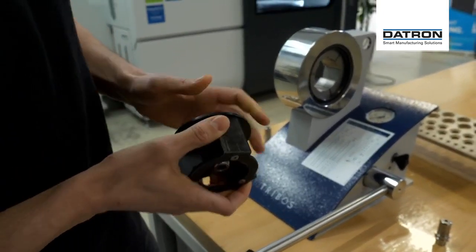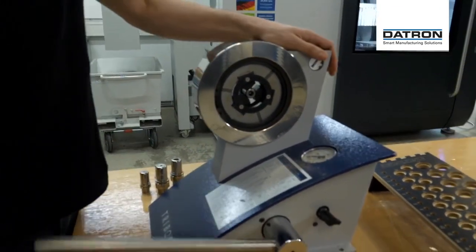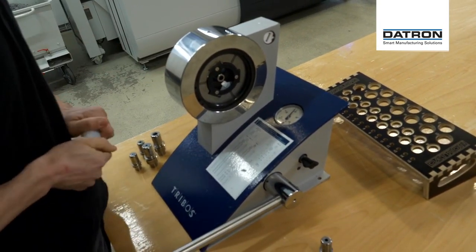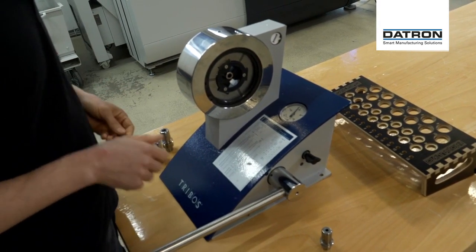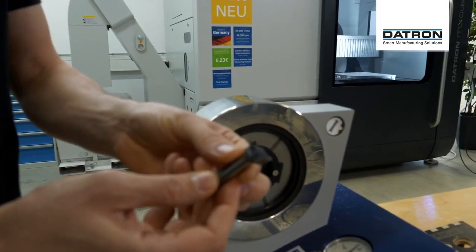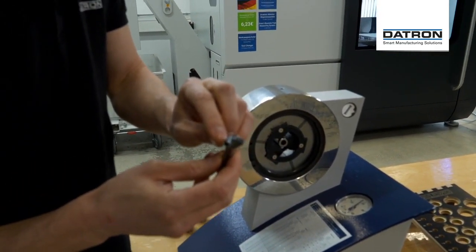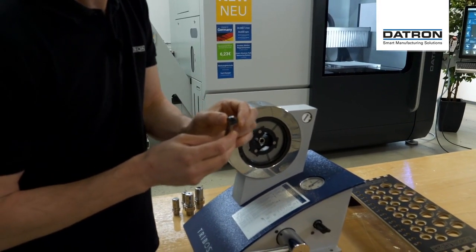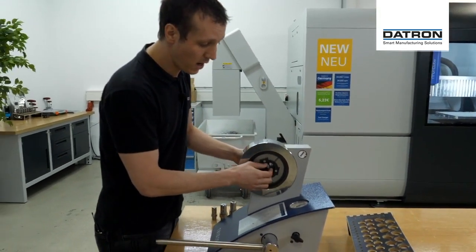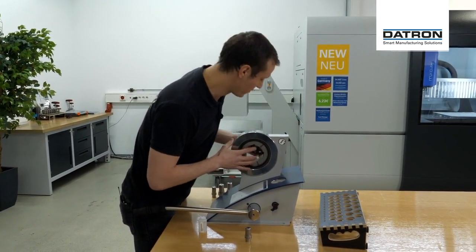So I do the reduction insert, close off the valve, and then I pump it up to 180 bar and now I can fit my 10-millimeter shank perfectly. By the way, this special tool is a brand new balanced single flute step cutter — it has a shank of 10 millimeters and a cutting diameter of 20. A very awesome tool for face milling and roughing operations. Later this week on Friday we have an online workshop all about tools, so don't miss that.